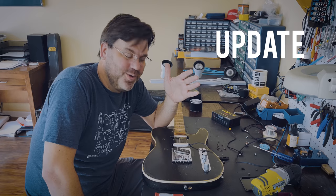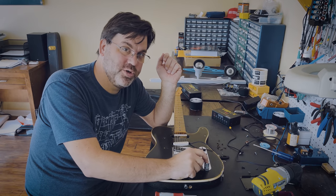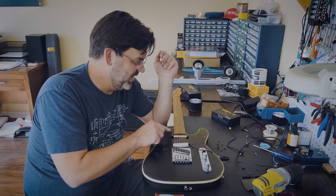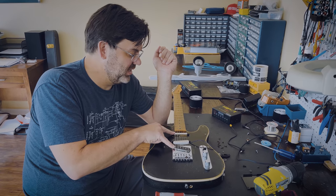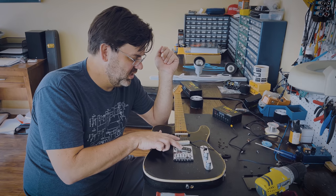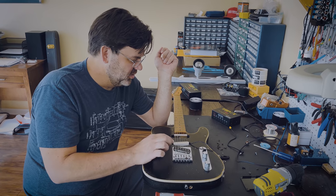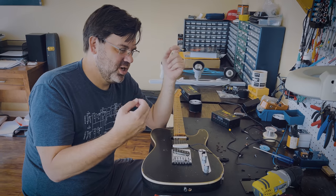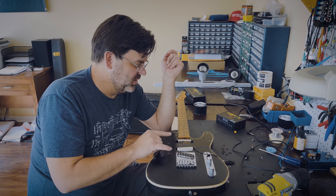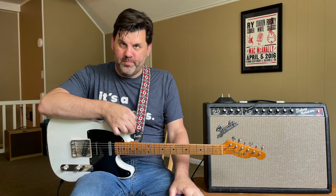I made a glaring omission — there's one feature I did not showcase: it has a push-pull pot. When you're in the bridge position on the selector switch and you pull up the pot, it activates the neck pickup. That way you don't lose that classic Telecaster outer two pickup sound. To boot, it also defeats the blend control. So if you've got this blended, pulling it up takes that out — because the blend is darkening things slightly, and by taking it out you just get the outer two pickups with a chimier and more natural sound instead of actually all three pickups. As soon as you push it back down, it's the bridge pickup with however much you've blended in. I hope you have a great week and I'll see you next time.